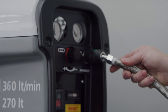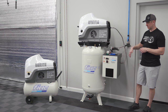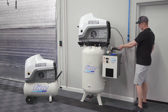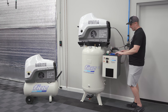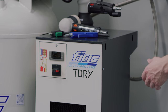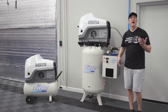I'm going from the Prevost S1 Euro high-flow out to a 3/8 plug, running directly into the 3/8 filter on the back of the dryer. The dryer is a pass-through device, so whether it's on or not doesn't matter. I just happened to get unlucky and the dryer is mounted backwards — airflow goes this way and back out. There are keyholes on the side and I'm still figuring out how to set it up; I really want to build a bracket to mount it right to the side of the tank.